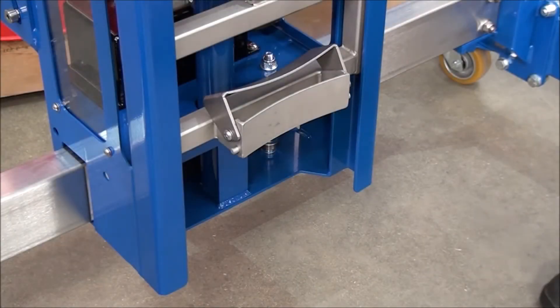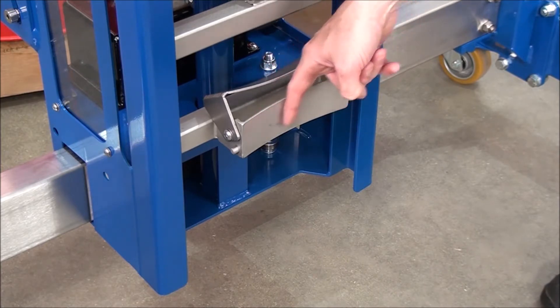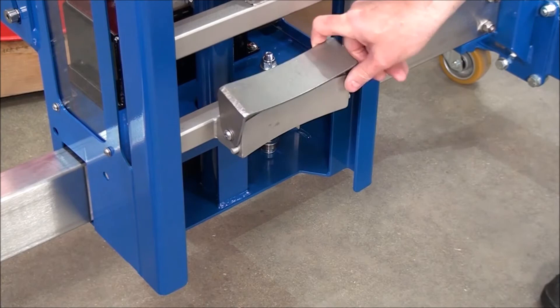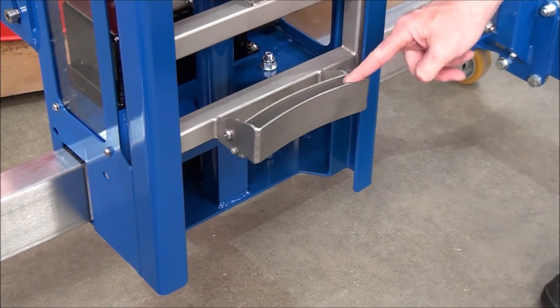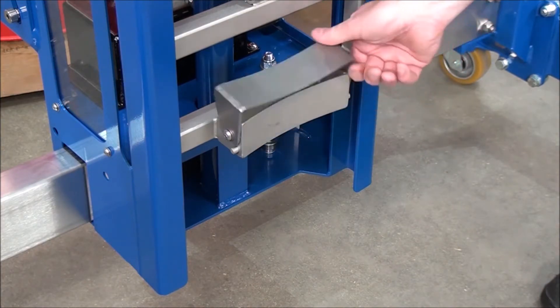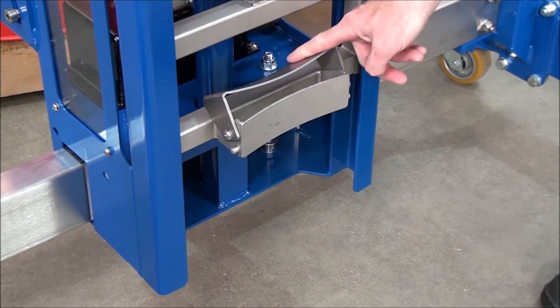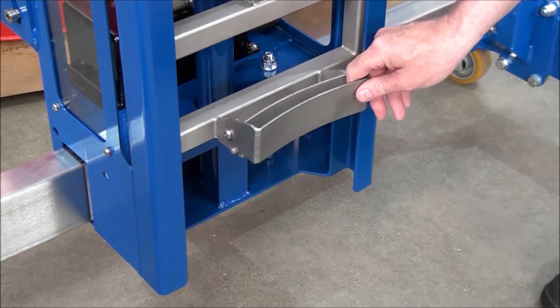We're now focused on the kick plate. This plate pushes on the bottom of the drum. If you want the drum to be more vertical, you can put it out — this spaces the bottom of the drum out and makes it more vertical. For most applications we'll have it folded up out of the way, and certainly for all Mausers we'll have it flicked up. It's there should you want a more vertical orientation.